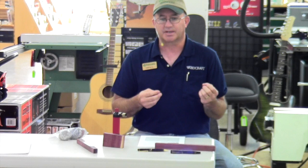Sometimes, like I've done a few jewelry boxes of Purple Heart and haven't been happy with the purple color, but before I put a finish on it I've let it set for a couple of weeks. Over that couple of weeks, the air getting to it has brought the color back to a color that I'm happier with. On smaller pieces like these pin pieces, we're usually trying to do them quick and get them finished.